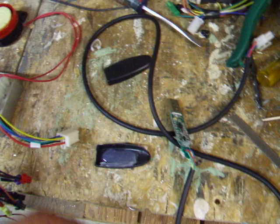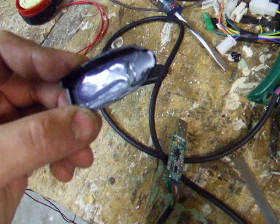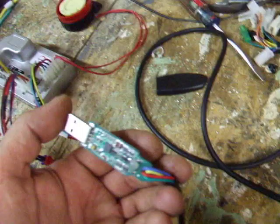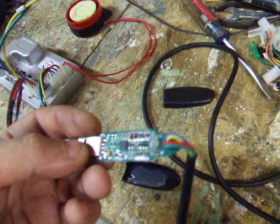I think the easiest way to fix it is to shorten the leads on the main wire here. Bring the insulation right up to the board, strap it with a small tie wrap, remove all the goop, and pot it — basically, because when you pot it, it'll make it all one solid unit. It'll hold the wire in, plus it will give some support for the USB jack. Because that's pretty nasty — even I could kill that easily just by wiggling it.